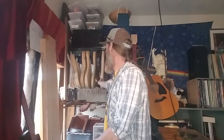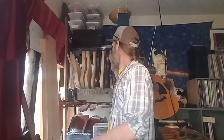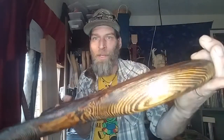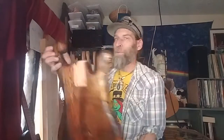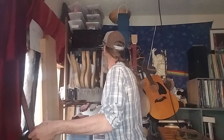Some of these are textured. The one I've shown you with the block designs — I have one that's textured where I used a wire brush and spent half an hour grinding out all these grooves. What that does is give it an older look, brings out more of the white between the grains, and turns it into a beautiful vintage-looking guitar. It's got a little volute at the end. A lot of those bodies are pine — I cut them out of that table and gave them time to breathe, because pine might bleed through with the sap. This is old pine, like 60 years old, so it's going to hold up.